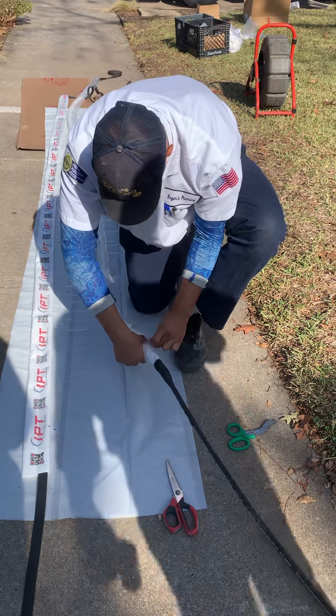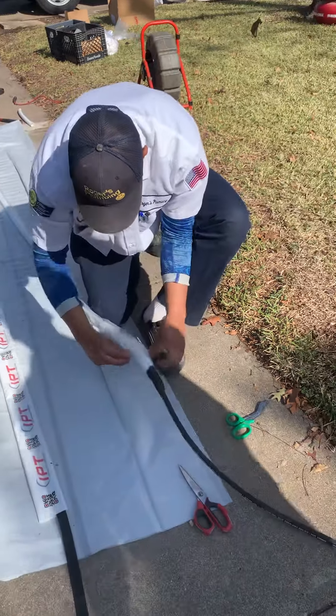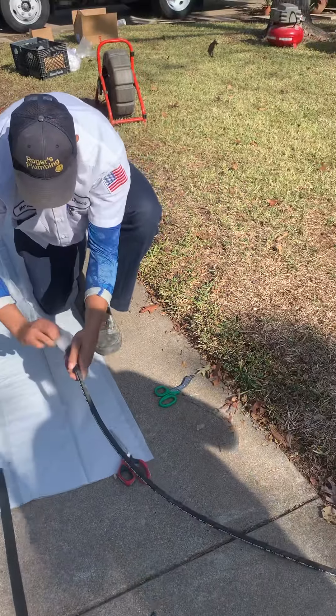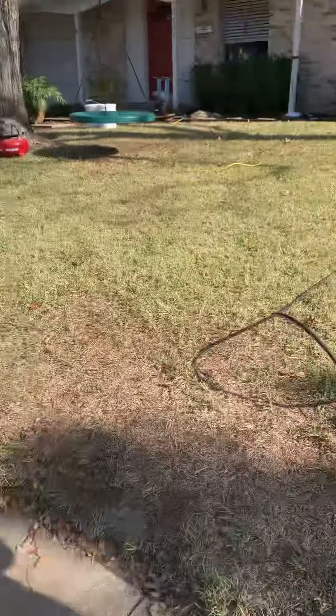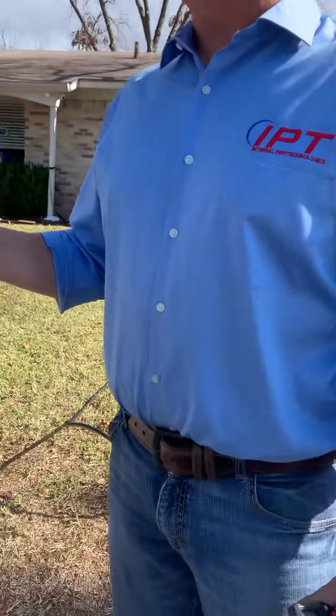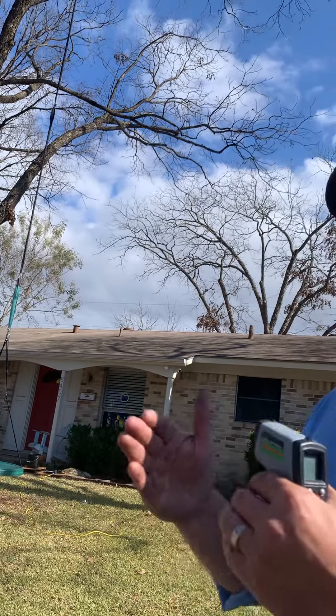There's no plastic on the two-inch, just the end caps. Four-inch, three-inch, four-inch, six-inch has plastic running right through the whole thing, because epoxy doesn't stick to silicone — silicone being the bladder material.